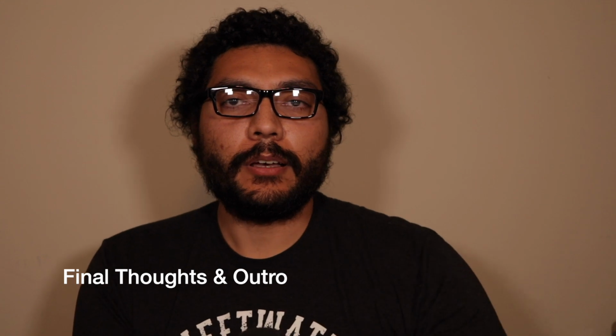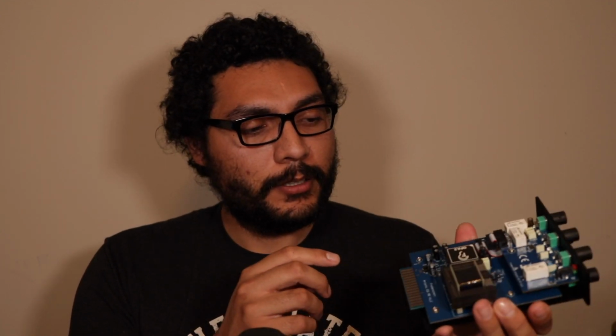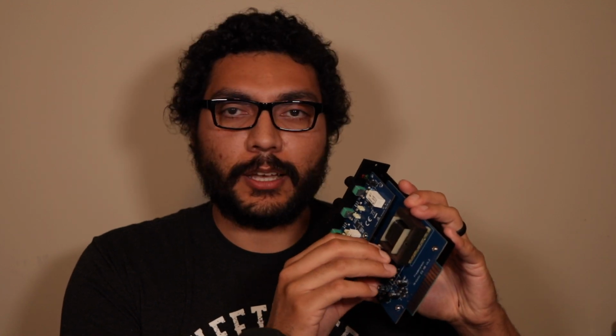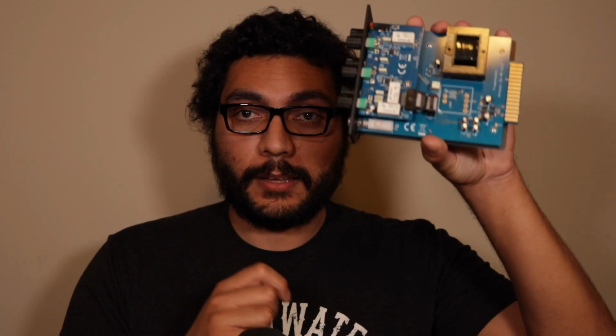So one thing I really love about the Fredenstein Artistic EQ is right here. This is the op amp location, and if you don't like it for whatever reason, Fredenstein does sell an OPA 1, which is an upgrade. Now, most of the time they're not socketed, and they don't have a socket actually. So if you wanted to remove them, you couldn't. You have to desolder them. But with Fredenstein, he creates a socketed system. That way you can simply remove it like that. Now, as you can tell, it's no longer there.